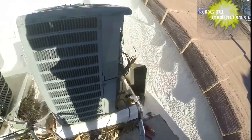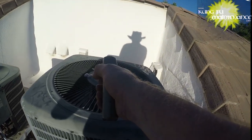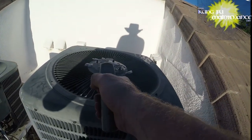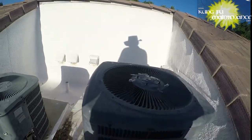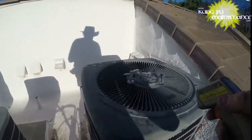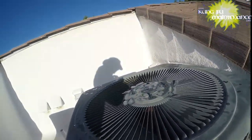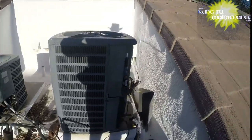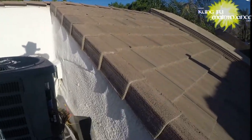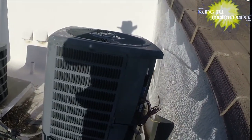We got fan. So I'm just going to give it about five minutes to shed that heat. I can kind of show you with the laser thermometer. Our fan temperature now — a nice cool 84 on the top. We're going lower, 110. Down at the compressor the fan blades are kind of in the way, but I can feel the cooler air coming off. I'm just going to give it a couple more minutes, get a drink of water and cool it down, and then we'll plug those in. We should be all set — unless we're low on Freon, so that'll be the next step if it is.